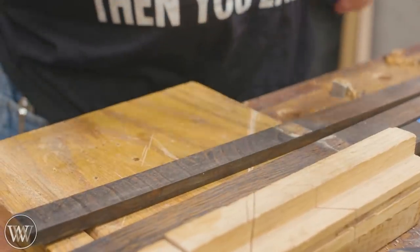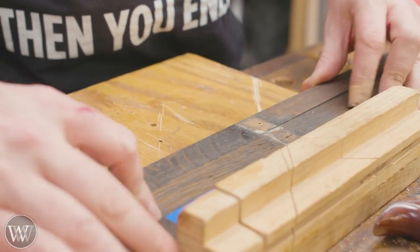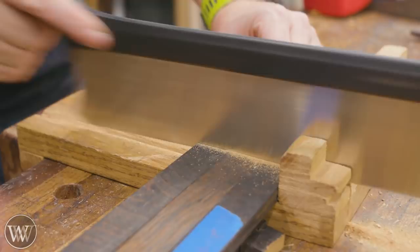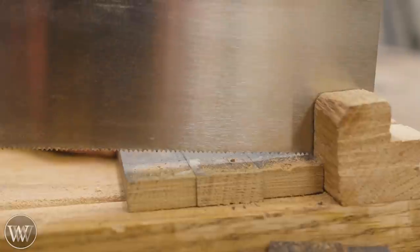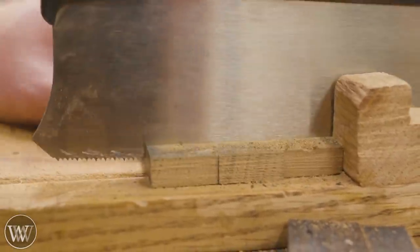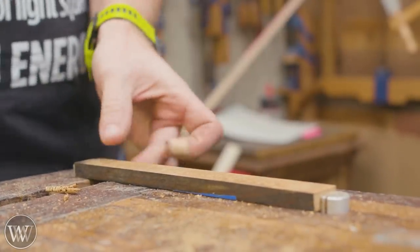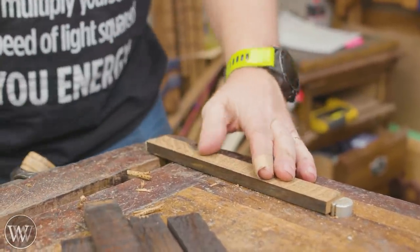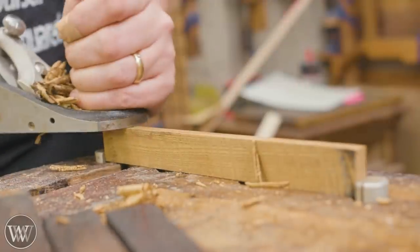Some of these little pieces were actually easy to cut in between. They came out of an old desk made over a hundred years ago in Michigan. It had been glued together with hide glue and had been falling apart — the glue had given out. All the boards that were glued together broke right at the glue seam, so I have all the original boards with their original cut and joint marks. These little ones were originally hash pieces in a mission-style desk, and so they'll get reworked into the hash work on this end table.